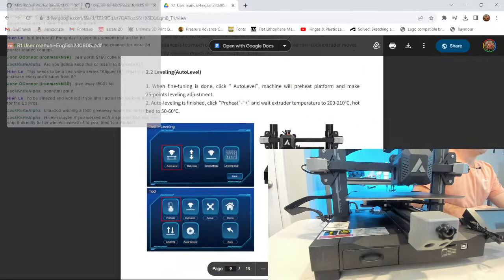I can't do this anymore. Okay. We're gonna go back into KIAUH. Instead of running how KIAUH does it, we're gonna try this. It's make menuconfig, make flash, so let's try that. I talked about this earlier, but I'm using my Inovato Quadra as a host device. It's not plugged in, obviously, but I'm just using it to create a firmware image because we can do that.